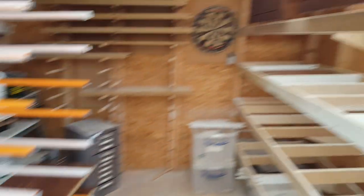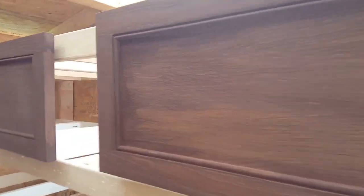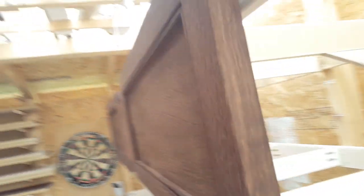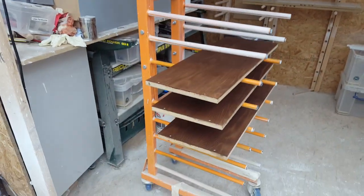This piece has had that applied, so you get a feel for the look of it there. We've got other bits at different stages. These doors we've hung up — you can see that's just got the stain on and it's still drying off. We've hung these up as a way to let them dry on both sides — you don't want to get finger marks and runs in the stain. So that's the finishing process.